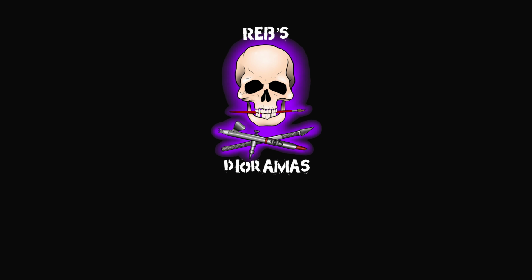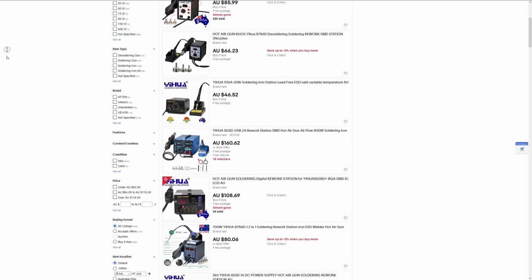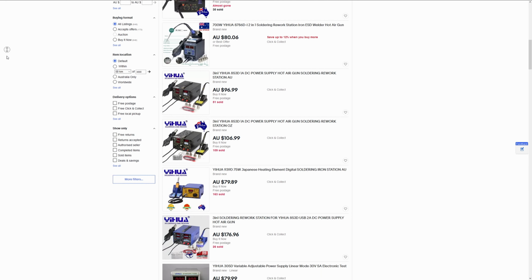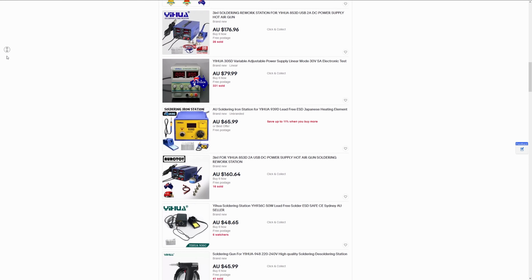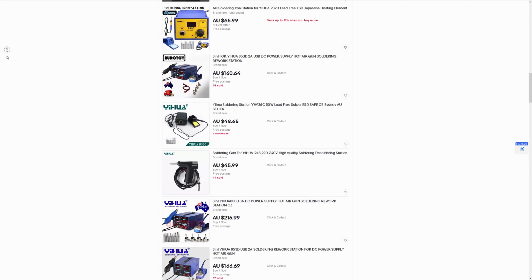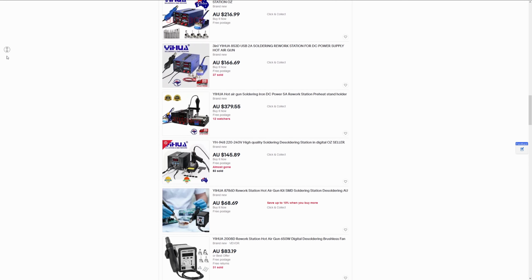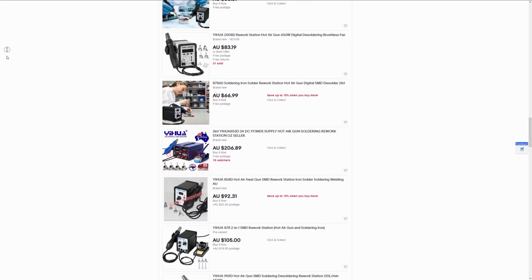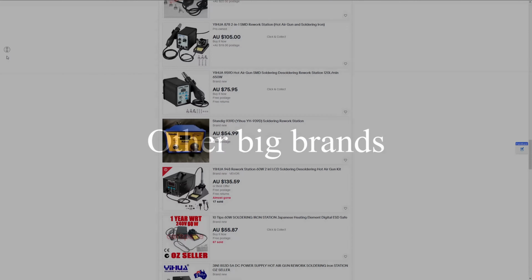Just like the USB soldering iron, I take no responsibility for any damages if you buy these stations. I'm just telling you about them, it's your choice to buy them or not. The Yihua Stations can be decent if you want a cheap temperature controlled station. A lot of them come with heat guns, which is handy for heat shrink or surface mount work. Some even come with multiple irons, so you can run 2 irons with different tips at different temperatures at the same time. You do have to be careful with these though, because the fuse can be incorrectly wired going through the neutral instead of the live, or worse, not connected at all. It's also quite common for these kinds of things coming from China for the ground or earth not to be connected at all. You can search or ask on places like EEV blog forums for help making them safe. There's plenty of people there that will help you.